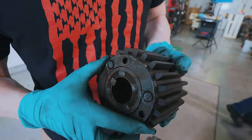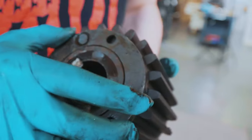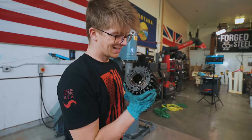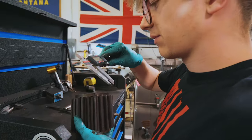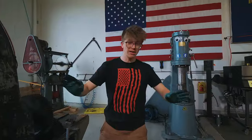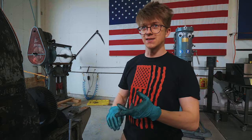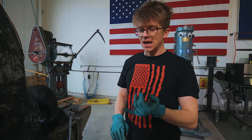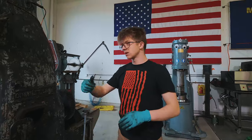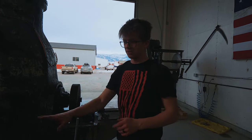This end plate is all loose and been dented and hammered on. It's an inch and a half hole, so we need an inch and a half shaft. We're going to measure the keyway: 0.370 — so probably 0.375, likely a three-eighths key. What we need is a motor that is 1750 or so RPM, three-phase, 15 horsepower, has a one-and-a-half inch shaft with a three-eighths inch keyway, and needs to be the right shaft length. At this point it's time for some eBay hunting.